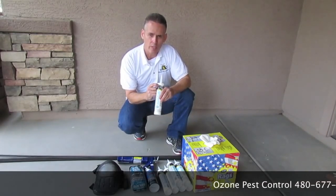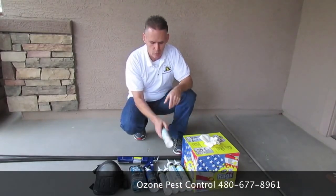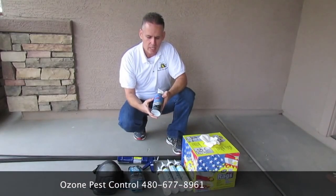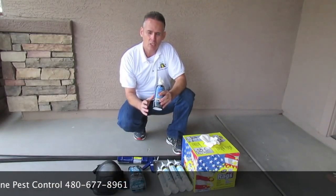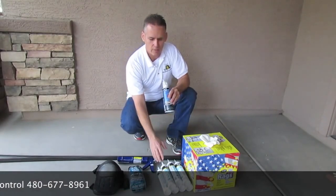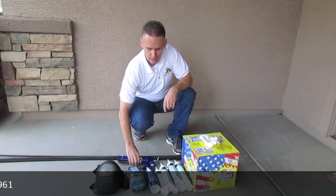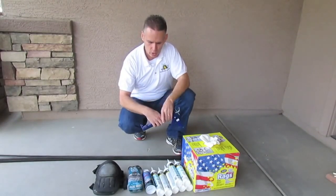It's very important that you make sure that it dries clear, because when you put this on, you don't want to leave a white mark wherever you use it. Another product for about 5 bucks a can is this DAP Tex Plus. It's a foam sealant. It expands just a little bit, just to cover a little bit bigger areas than you would with the silicone. You're obviously going to need a caulking gun, which for about $3 or $4 you can get also at Home Depot.